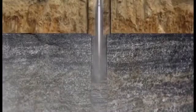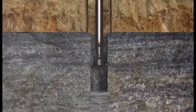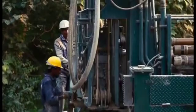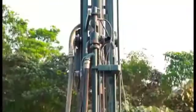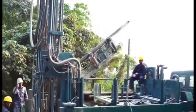After the drill bit touches the bedrock, the drilling continues another 2 feet into the rock at the same diameter. After the completion of the drilling process to soil cap, remove all drilling equipment out of the drilled hole.